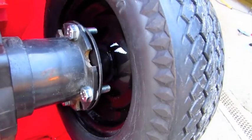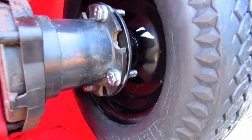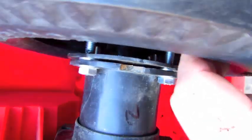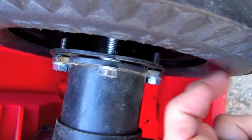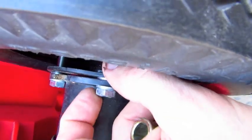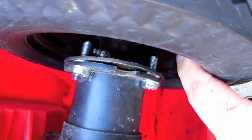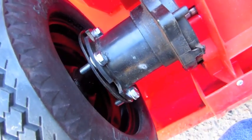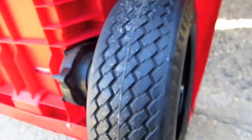What I ended up doing is I took the same wheel — all four of these wheels are the exact same — but I ended up welding a metal flange on the back. Then I tapped threads inside the flange, set a spacer washer and a washer on this side, and bolted them on. So there are four bolts on there, and it also has a Zerk fitting in it.